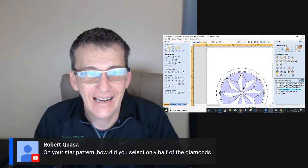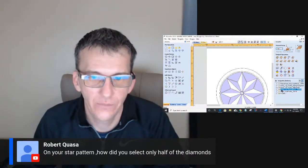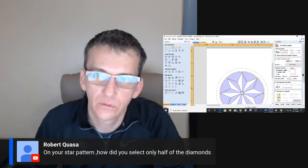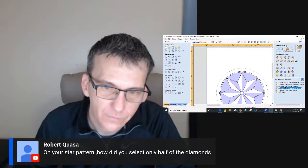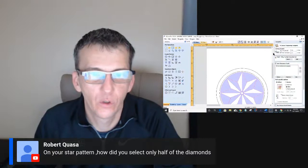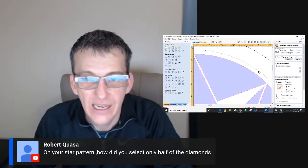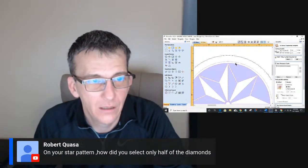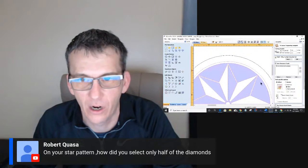Now, had I carved this toolpath, oops, wrong toolpath, sorry, close. Had I carved this toolpath and had this additional vector selected, it'd be a whole different story. It would actually be carving this ring and inside of here, leaving these areas raised. All the blue areas would be raised and all the white areas would be carved down.